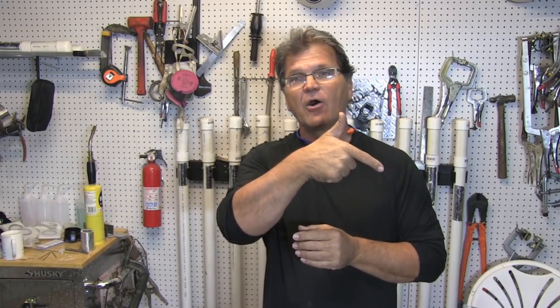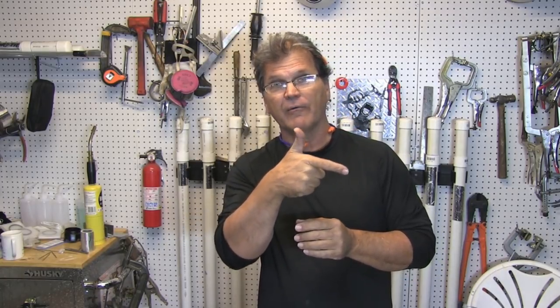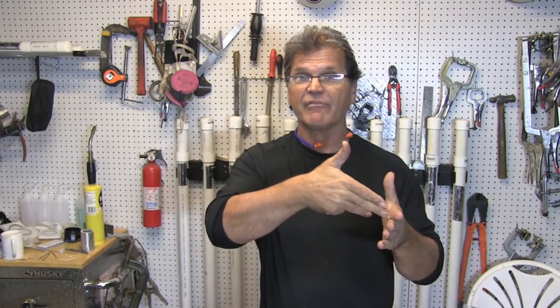So it's good to get some practice on this eighth of an inch material, because the skill you need is to learn how to keep that arc in that sweet spot of the puddle, right near the very leading edge as you're going downhill. That's the skill. You go too far ahead, you shoot wire through; you hang back too far in the puddle, you don't penetrate like you need to. It's all about gun angle and stick out as well — you've got to have those just about right.